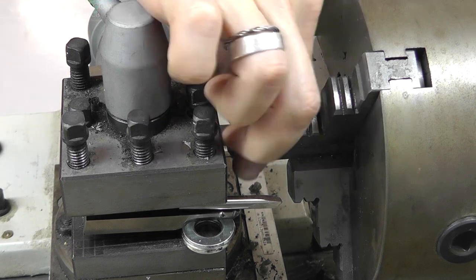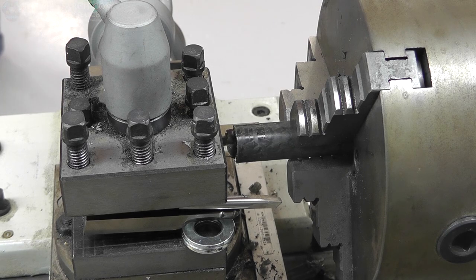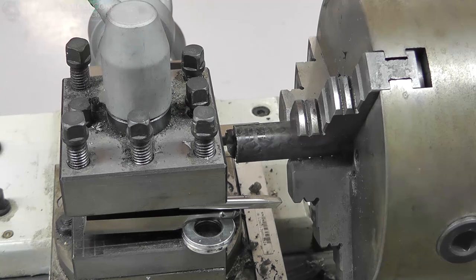So originally I was going to use that cutoff tool, but I ended up not using it because I did not want to move the head around, like spin it around. I wanted everything to be identical. So I got everything set up so that it's square, the tool is square, everything's square with the plastic. And then basically that boring section that you see on the front is going to be stationary, and the wheel cutting, the actual channel, the profile, I should say, that profile cutter will be chucked in the other side of the tool holder and it will not move.